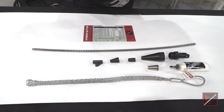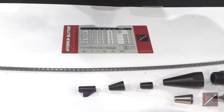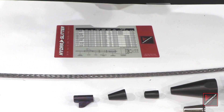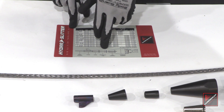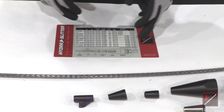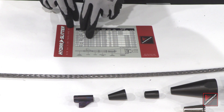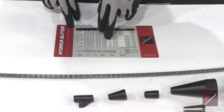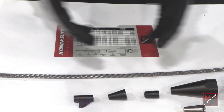For this example I've chosen one of the most common setups I've seen here in Wisconsin: an existing lead line that's three-quarter inch in diameter being replaced with a one-inch diameter poly line. First thing we're going to do before we assemble is take a look at the card. Look at the image at the bottom and get an understanding of where each component is going to end up laying. Then take your pipe sizes, go down the left column, find them, and work your way to the right to pick out the individual components you'll need to complete this job. I've already done that for us and everything we need is right here.